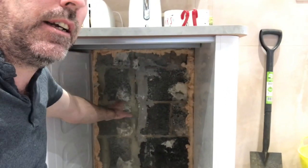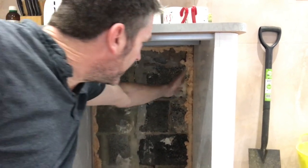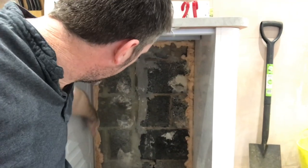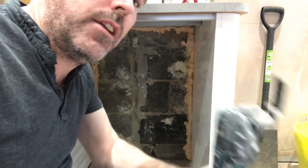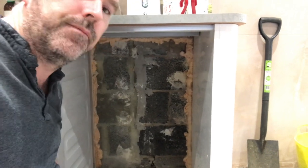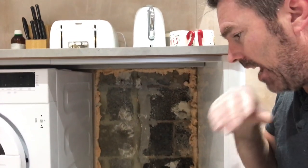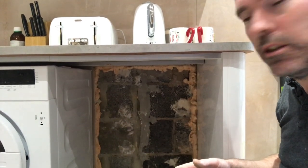As you can see, it's all cleared out now — nice big gap. We'll go get the dryer now. It's dry, so you just cut the foam off with a sharp tool, or you can use just a flat scraper — slide it like that and it'll cut off neatly. As you can see, I've just put some holes in there for ventilation because on this side there's going to be a panel going on, and at least there'll be some circulation going around. You always have to think about ventilation and air — even products which are integrated still need air, same with fridges, with everything.